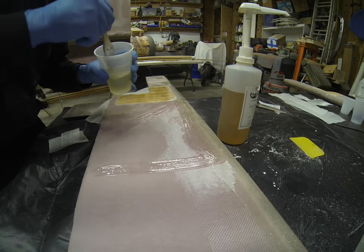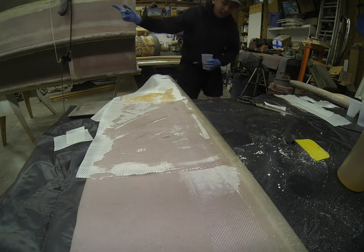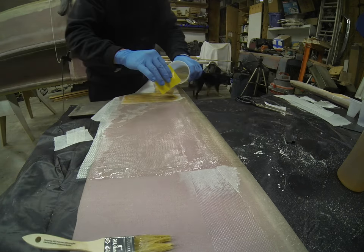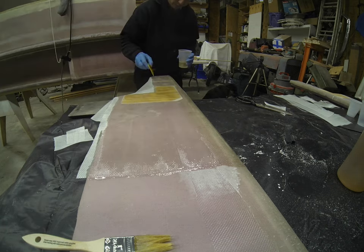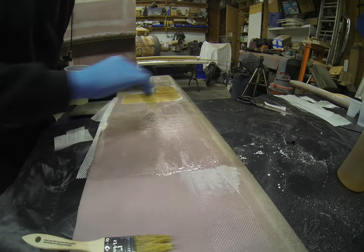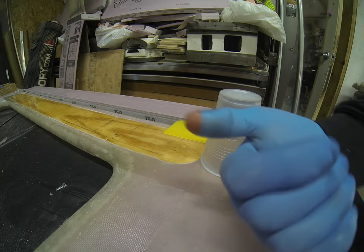One thing you can do is kind of roll the brush on and off of your part — that'll keep the glass in place right where you want it. We're gonna bias this piece in the direction of our anchor point. The final piece is gonna be this big boy and we forgot to prep that right there — I want to do that real quickly. The entire airplane community is recoiling in horror right now. Time for a new pair of gloves.